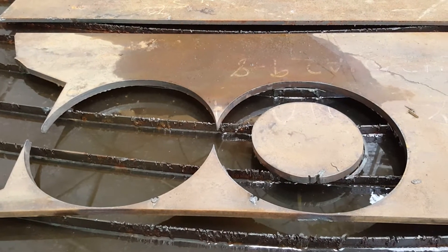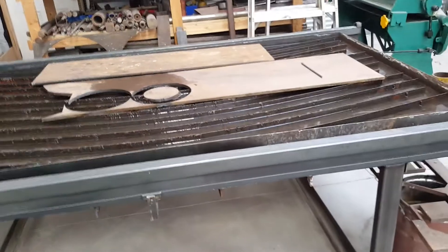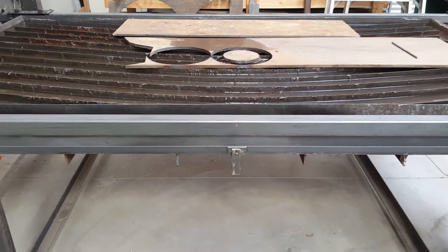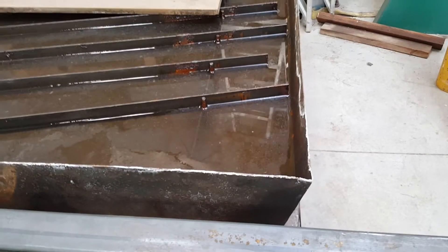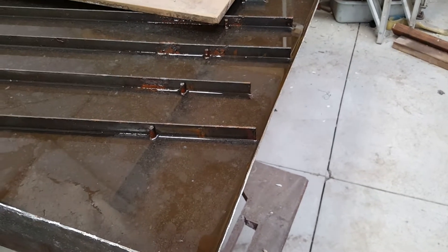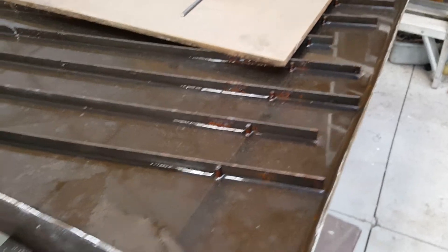Here today I cut the base and a mount to mount the device to the welding table. It's a half-inch table. I can fit a four by eight sheet on it. It seems like a lot of the stuff now is four by ten, so I kind of wish I maybe made it a little bit bigger, but it manages. Very seldom do you need the full sheet. The only issue is on the water table — the grate sits down lower than the pan I built, so I need to trim it so it's level with the grates. That way I can just hang the extra two feet over the end; otherwise it's at a little bit of an angle. Even though we've got torch height control, I still like to keep it as level as possible.